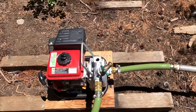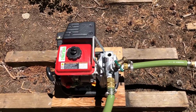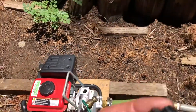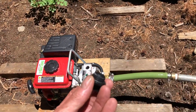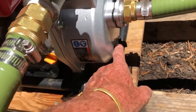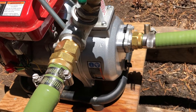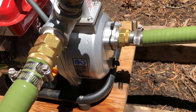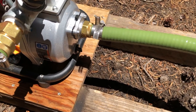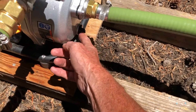Okay Aqualinkers, here's a little refresher on the pump. Found out this year that one of the o-rings on the bottom plug down here had degenerated over the winter and it leaked. So I wrapped it with plumber's tape and tightened it up, because when it leaked it actually lost the prime and so it was running for a few minutes with no water. So make sure this is tight.